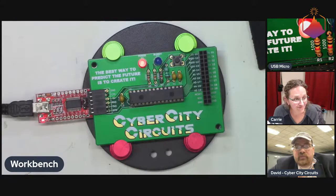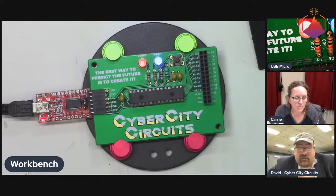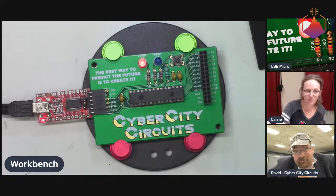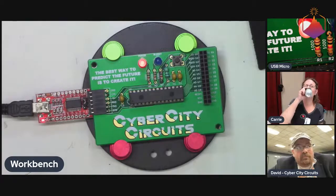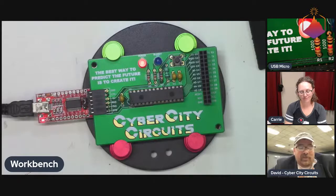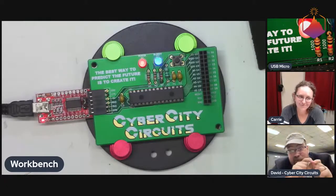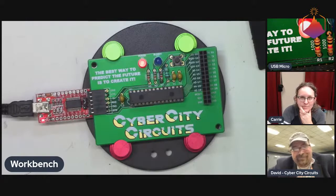Bob just said, I like the change up to use FTDI to power. Oh, so he likes that I'm using FTDI power too. There's a reason for that. Another thing about soldering kits: they do make through-hole USB mini connectors, but you can't pack them into kits because the pins get bent. And if the pin gets bent even a little bit, you cannot fit it in the board. So you cannot pack kits with through-hole USB mini connectors because you will get annoyed customers. Also, the pins are really close together, and if they bridge and they plug it into their computer, you didn't do them any favors.